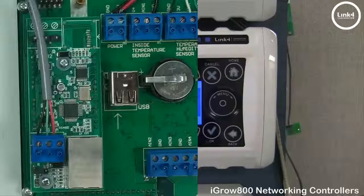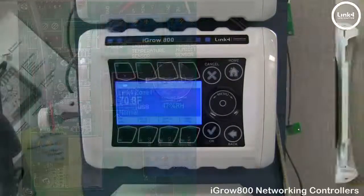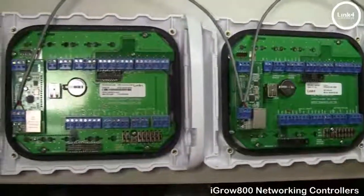The following controllers, or remote controllers, you only land two wires: one on A and one on B. One after the other, daisy chaining A to A and B to B, using 24 gauge shielded cable.